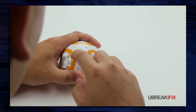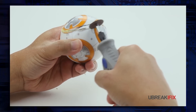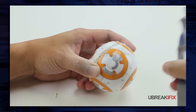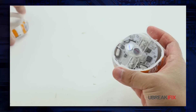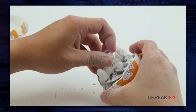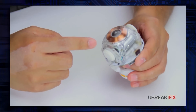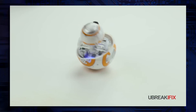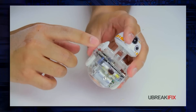With only one tightly sealed seam connecting the two halves of BB-8's shell, we are forced to break out the rotary tool and go into surgery. Sorry, BB-8. After progressively cutting more and more cover material away, we are able to free the internal mechanism — the heart and soul of the BB-8. Like we suspected, a gyroscope and two wheels are used to keep BB-8 upright. The large counterweight keeps the two wheels in contact with the shell, giving the internal mechanism traction and allowing it to right itself at all times.